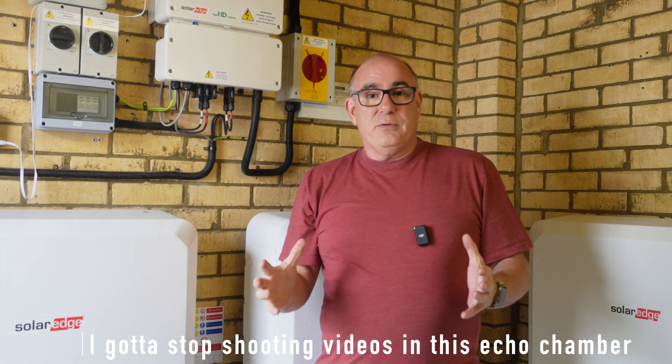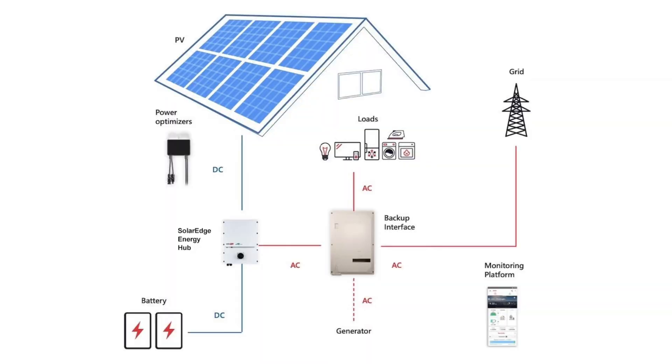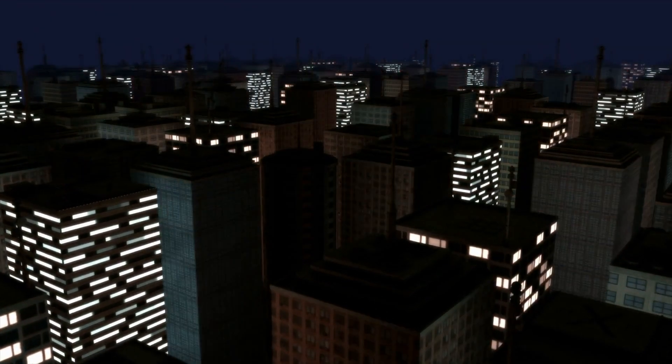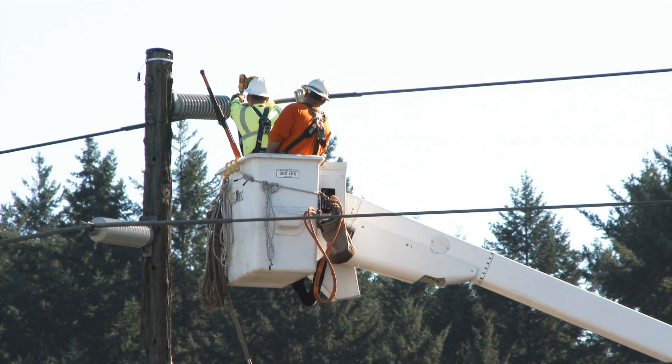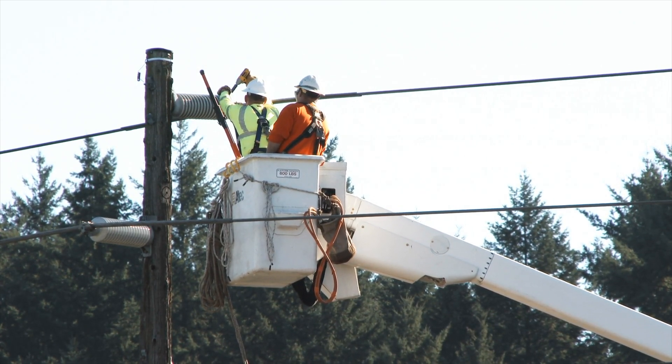Now what's the difference between the two? Well the major difference is the home hub inverters support something called island mode. This effectively allows you to use your solar system when you're off-grid — whether that's a momentary power outage or a much longer term one. With a standard inverter, your system shuts down because you don't want power from your solar panels or batteries flowing back into the grid, potentially causing harm to somebody who might be working on it.